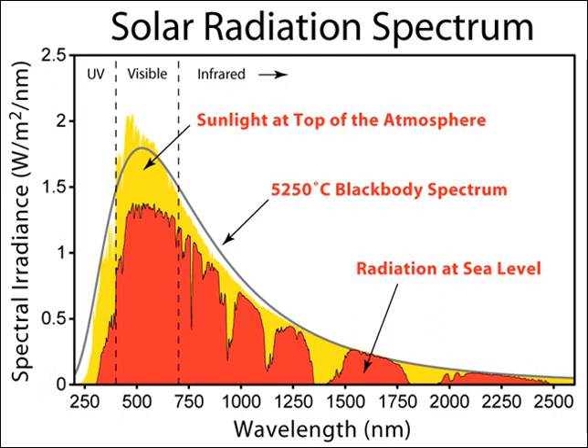The wavelengths in the solar spectrum range from approximately 0.3 to 2.0 micrometers. Thus, in order for a rectifying antenna to be an efficient electromagnetic collector in the solar spectrum, it needs to be on the order of hundreds of nanometers in size. Because of simplifications used in typical rectifying antenna theory, there are several complications that arise when discussing optical rectennas. At frequencies above infrared, almost all of the current is carried near the surface of the wire, which reduces the effective cross-sectional area of the wire, leading to an increase in resistance.